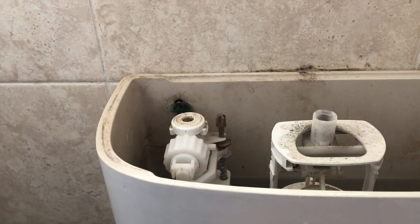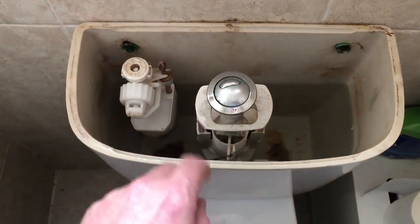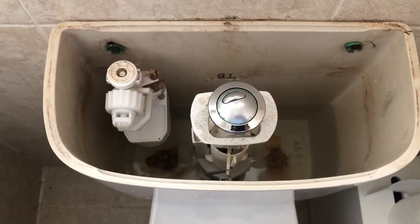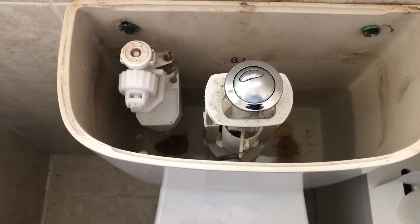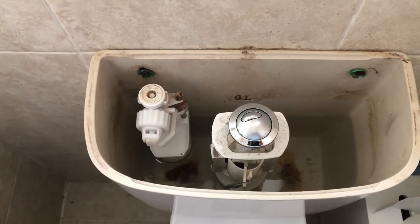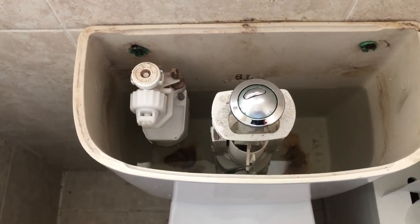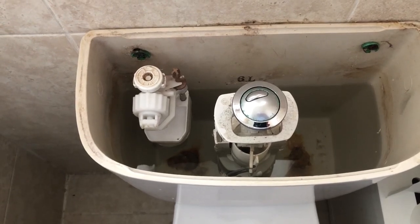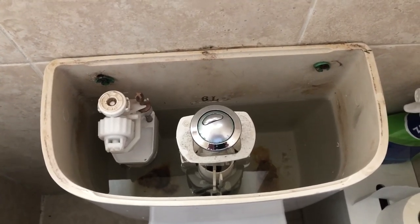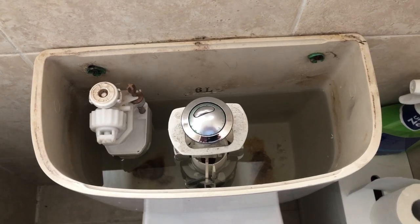We'll turn the water on and see what happens. I'll just show you how to flush the toilet — put the push button back in and just press. Watch the water level as it rises. It seems to be refilling at a considerably better rate than previously. There's a tiny little drip there — I'm not sure what's causing that but I'm not particularly worried. We'll sit with this until it shuts off. See the float just twitch there as it rises up, and it should shut off now. So I think we'll call that job fixed on the cheap. Many thanks for watching — and why not subscribe to improve your knowledge of repair possibilities.